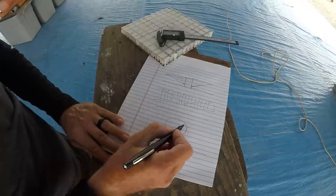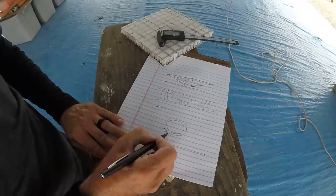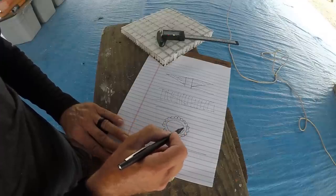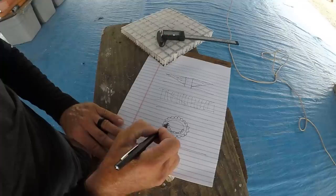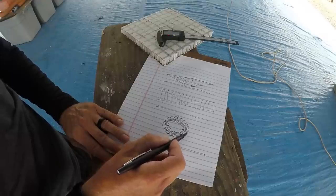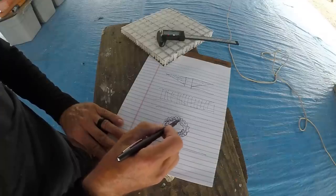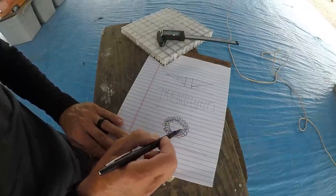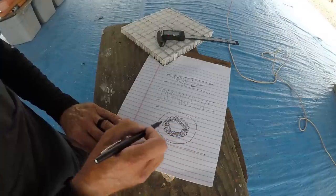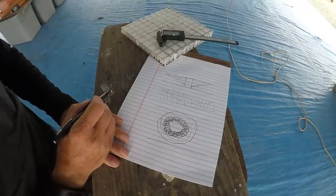Here's the through hole. I put a patch in here of the same core. Now the honeycomb looks like this if you look at it around the hole. And on the patch, just the opposite. So as I inject thickened epoxy around this perimeter here, it fills this whole void and locks this plug in, creates a spline, makes it impossible to pop it out. After that's done, you could grind back all the surface coating and lay new glass cloth on here on both sides. Works out pretty slick. I'll show you how I do it.